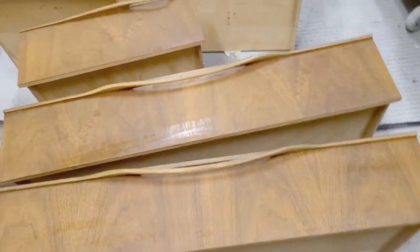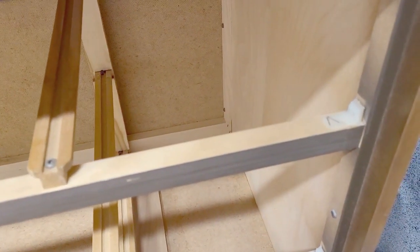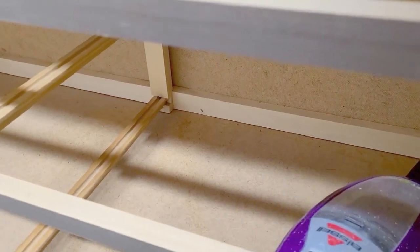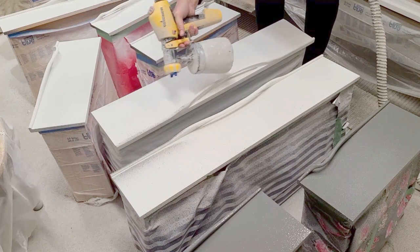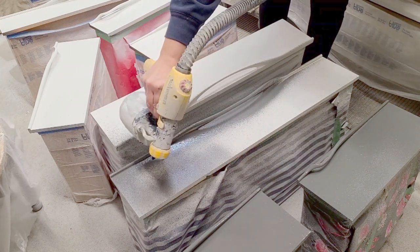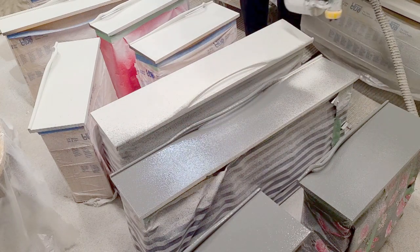Once I had gotten the legs, trim, and top all sanded, I wrapped them up. As you can see, I had plastic wrap on the top and the bottom, then used my vacuum to vacuum out any dust or dirt — but this piece was literally very, very clean; I didn't have to do much at all. I used wrapping paper because I didn't have any other plastic painters tape and had ordered more but it hadn't arrived yet. I used the rest of the plastic painters tape and some wrapping paper, wrapped around each drawer, and had already primed — though I forgot to record — priming each drawer, the sides of the dresser, and all the trim in between each drawer.